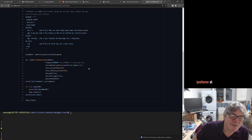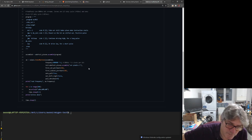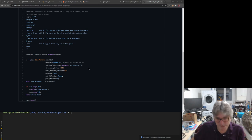Yeah, one of the things he was looking at, Laurie, I thought was quite interesting. So he was thinking, because CircuitPython is mostly single thread right now, unlike MicroPython, that he runs CircuitPython on one core, and then he can run C on the other core, the real-time stuff, as well as all the PIO stuff, which is an interesting way of looking at it.